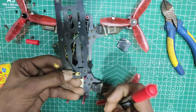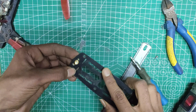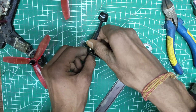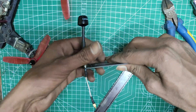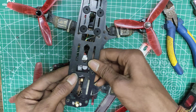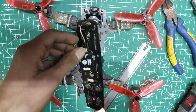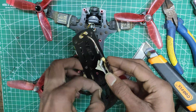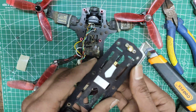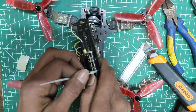Next is marking the screw holes. After that is done, I can finally screw the antenna mount to the frame with M3 screws. As you can see, those screws don't create any obstacle for the antenna to screw in. I think it would be fine to place the VTX like this on the top plate — some double-sided tape and a zip tie would get the job done. The thing to be considered is that there is a USB port on the VTX, so it should not be obstructed by any zip ties. Securing this piece with the zip tie, and this process is almost done.